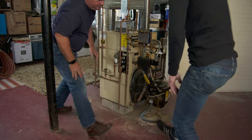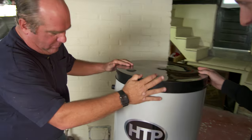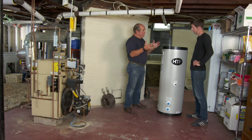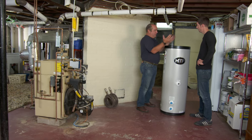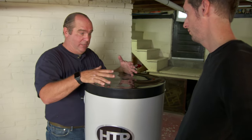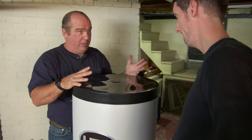What I want to do is use the boiler water to heat your faucet water in a different way. What we're going to install today is an indirect hot water heater. As its name suggests, it's indirect — there's no direct flame, no burner underneath with a flue. This is really like a giant thermos bottle. It's stainless steel on the inside, not glass-lined steel like a regular water heater, and it's got two inches of insulation on every surface, top and bottom.